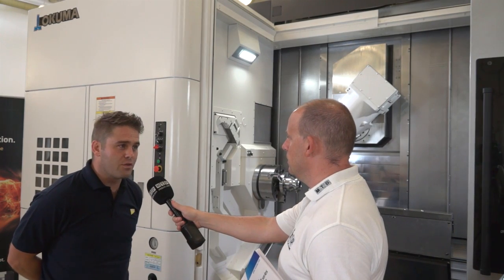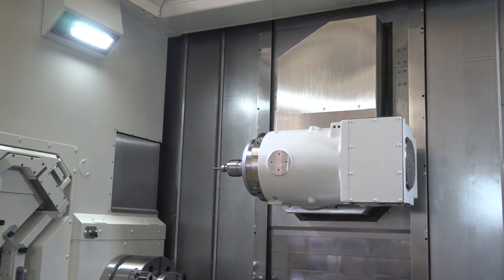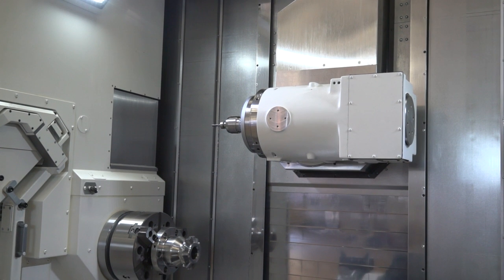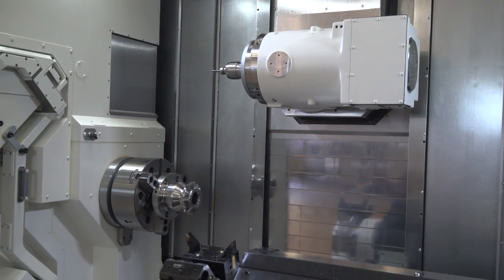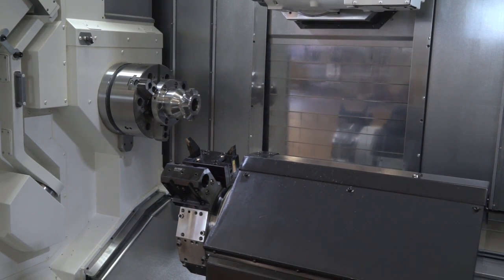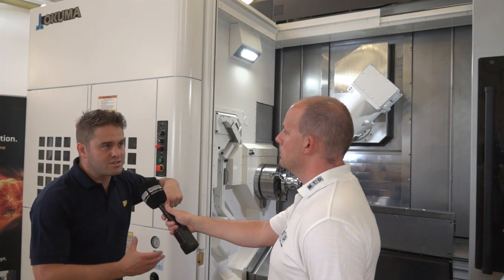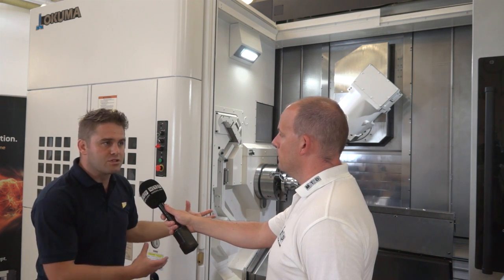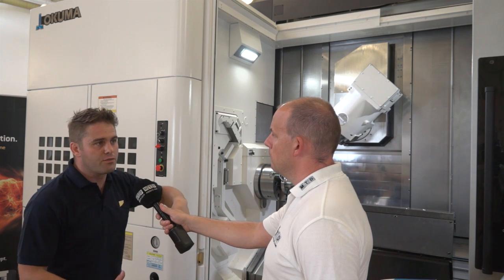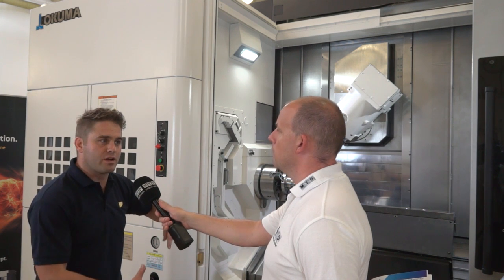And how often will it do that — do you have to ask the machine to do that or does it do it naturally? You ask the machine to do that. It's a very simple, easy walk-through procedure on the screen giving you pointers on how to walk through the system. What that does is set these geometric tolerances. What no one else can do is — because it's onboard — it's not just setting the kinematics of the machine, it's also setting the straightness errors of the machine. So it finds an axis that's not quite straight and puts a calculation into the control, so as it's moving live, the machine will actually be moving in multiple axes to take out any straightness inaccuracies.